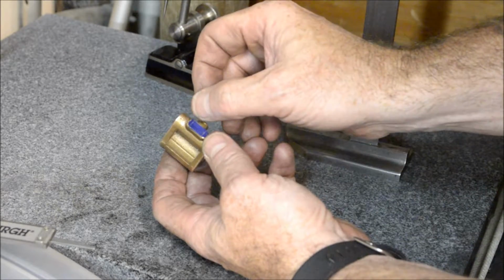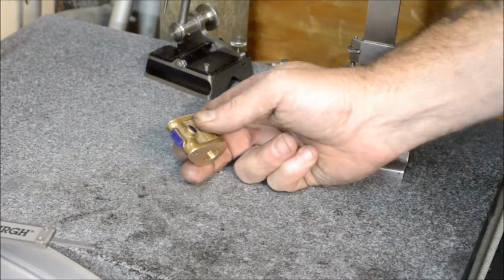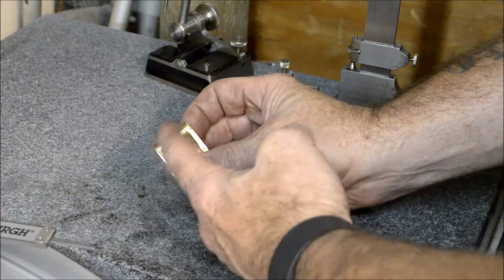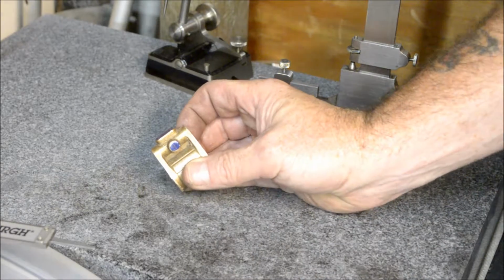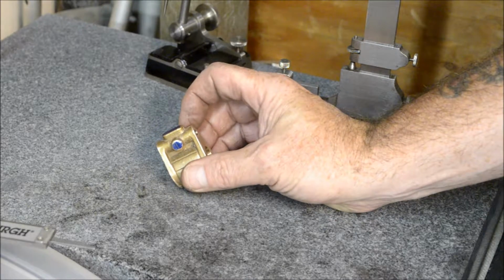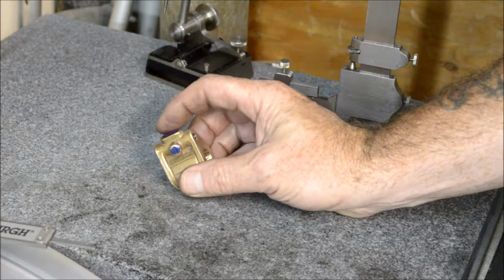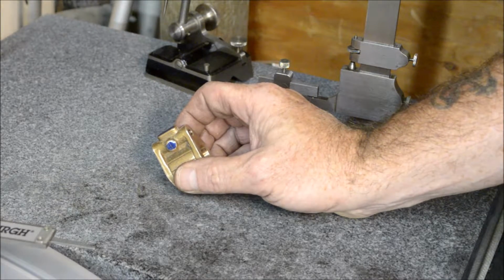Okay, so on the center of this boss, on those marks, I gotta drill two holes. They are 3/32, 11/16 deep, and then I have to drill again. I can make a counter bore with a number 38 drill bit, 1/8 of an inch deep, and then that counter bore will get tapped with a 5-40 tap, and I'll have to use a bottoming tap, and a set screw in there acting as a plug. So I'll get it set up on the mill and bring you back when I'm ready to drill.